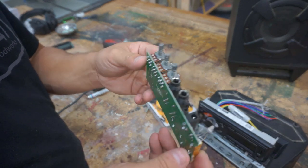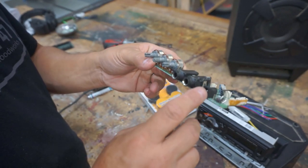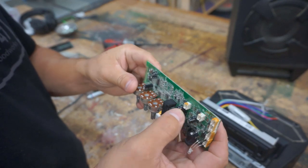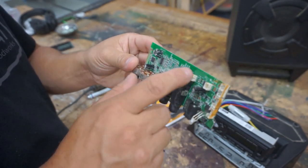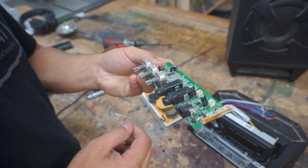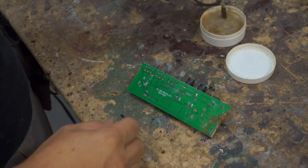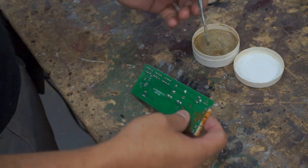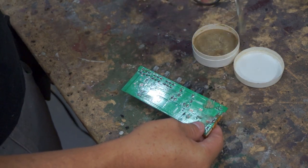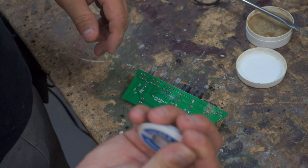We have this electrical board from the back of the karaoke machine. I want to salvage some of these parts if we can — like the 12-volt barrel plug and the two adapters for the speaker wires. I could hotwire the wires in, but they've still got the connectors on them, and I want to try to reuse the connectors on the board and hook up some wires to the back so if we ever need to take it apart it'd be easy to separate. So we're going to try to desolder some of these parts. I don't have a hot air desoldering station, so we're going to take a little bit of flux paste and put it on the pads we want to remove. I also have some desoldering solder wick — it's just copper that's been woven together.